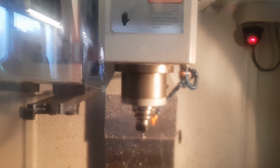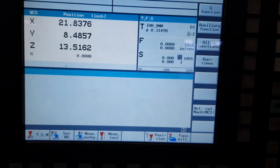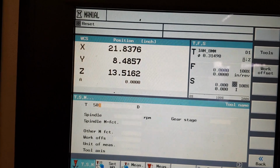So there we go, the Z axis goes first, and then the X, Y and fourth axis, which is axis A on this machine, then all go round to their zero sensors to zero themselves in. And then I need to start the spindle up on a nice slow speed, if I can remember how to do it. So I think it's this, and we'll punch.